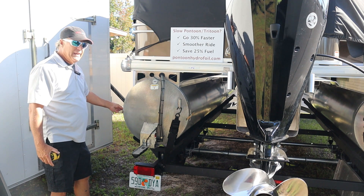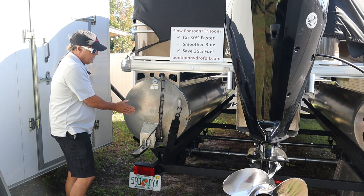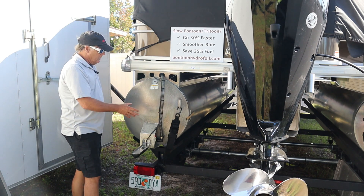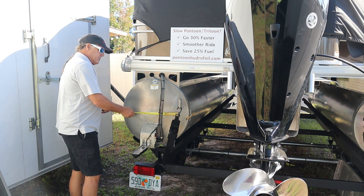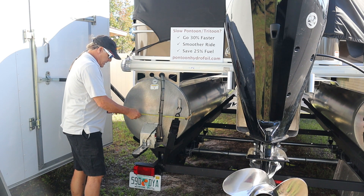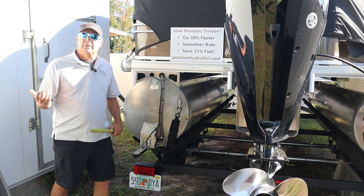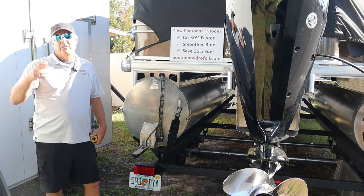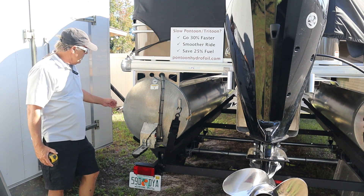One way to take that measurement is to go ahead and put stir sticks on the outside flat tubes. Because of this convex shape, it allows us to take a straight tape measure from side to side. We end up with a dimension of 23 and three-quarters, so we round up to 24. That's the dimension you'd fill out using this method.